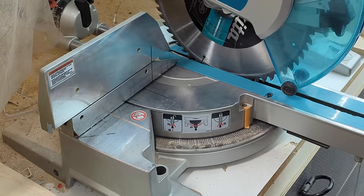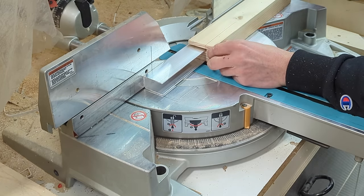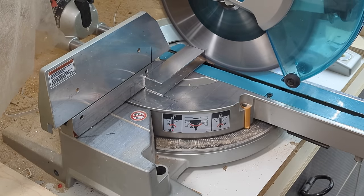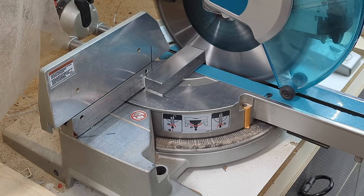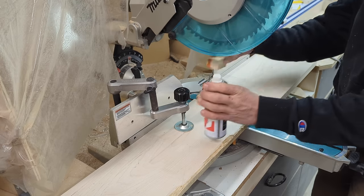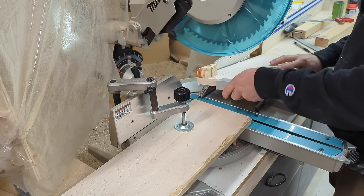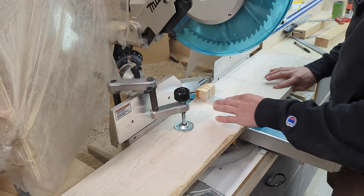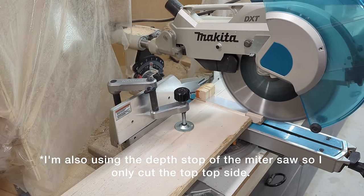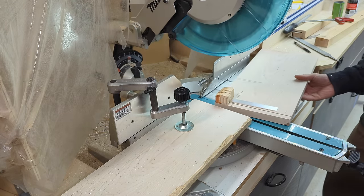To cut the aluminum I'm using the miter saw. I really enjoy having some kind of wooden support for the aluminum I'm cutting — whatever weird mishap of an edge getting caught is just much less violent if you've got a piece of wood supporting the aluminum. To get consistent length — it just needs to be roughly five inches — I'll use a pencil line on the miter saw, and I've cut a couple grooves into a scrap piece of wood to help hold the aluminum against the fence. For the half-face cut, I've made a little scrap bracket jig so I can clamp down what I'm cutting and keep my fingers away from the blade.